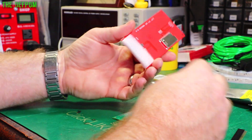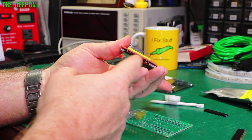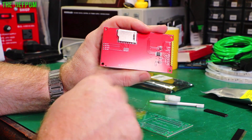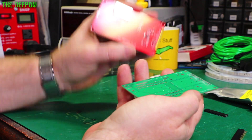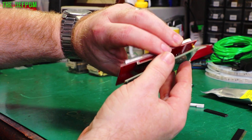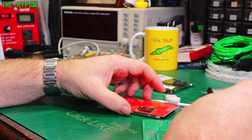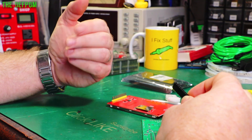I've already got a display here — these have pin headers on the side. The pins are bent so I have to straighten them up. It's the 3.5 inch TFT SPI 480 by 320 display version 1. Once those pins are straight, it will just basically pop through the end here and connect to the board. I don't like to do direct solder connections to things that may need replacing in the future — I like to make things plug and play.